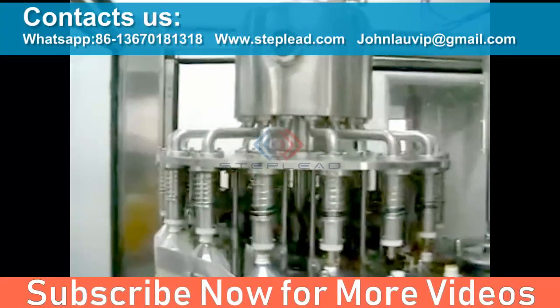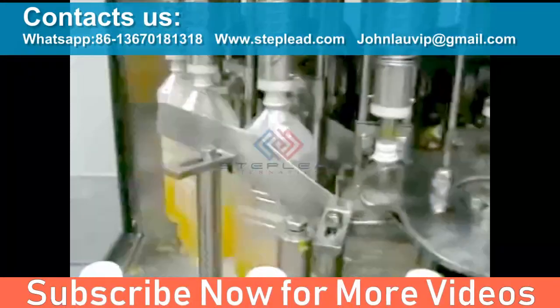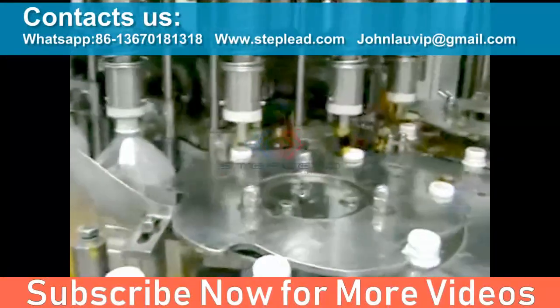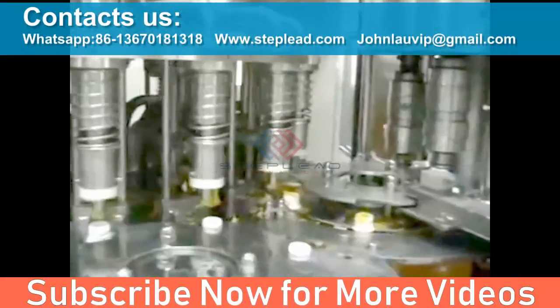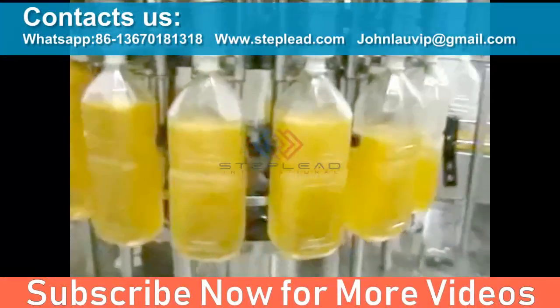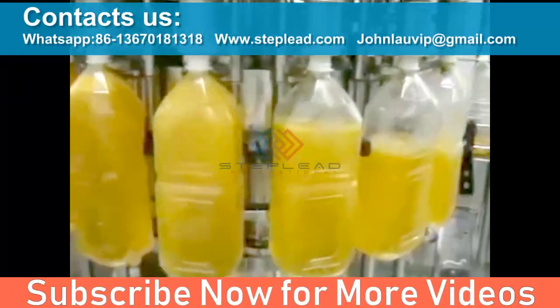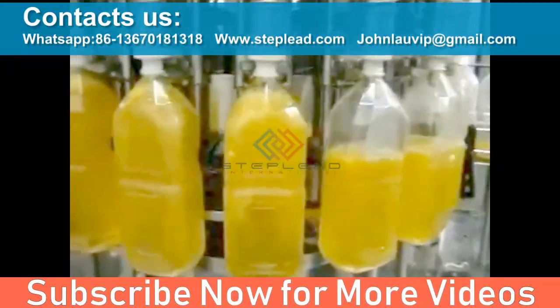After this process the bottles come down and a feed star will take the bottles from the filler and feed them into the crowner. Rinsing: the bottles are gripped by the neck and turned 180 degrees upside down by special grippers. Warm water is sprayed inside the bottle for a period of time. After leaving the spraying section, the bottles continue to move upside down for a while to drip water, then turn back to the upright position. The nozzles have a no-bottle, no-spray system activated only at the presence of bottles.